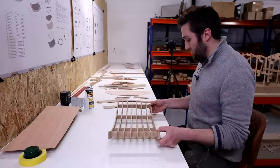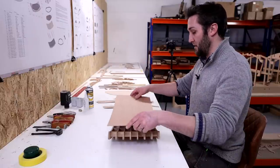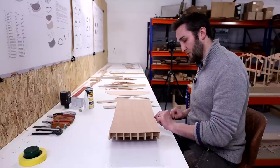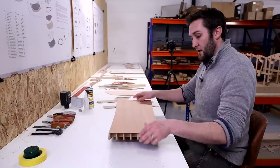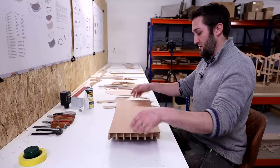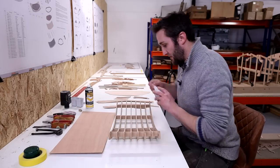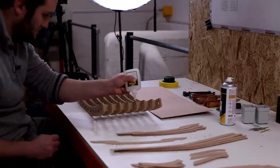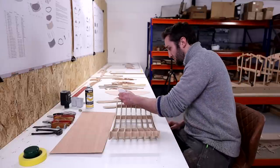That is our initial form, and now we've got to put a skin on that. I'm using a piece of ply — I've got one and a half mil ply and it's ideal. What the plans spec and what I'd recommend is an MDF or even a melamine-faced MDF. You probably can't get melamine-faced MDF in 6mm thickness — this wants to be 6mm for the real boat, this is 1.5mm here. That will spring into the curvature. We then want to stick that skin on the inside and I'm going to try that with my quick-setting mitre fix glue.